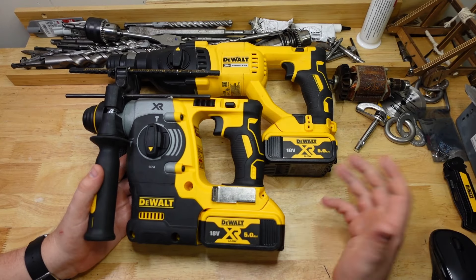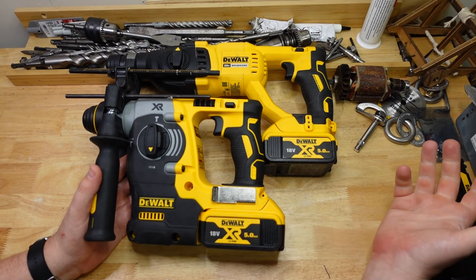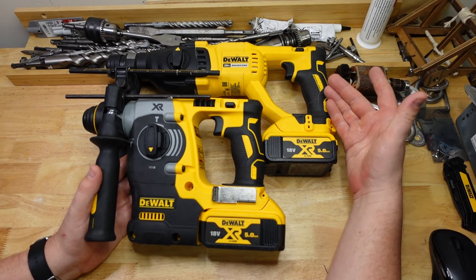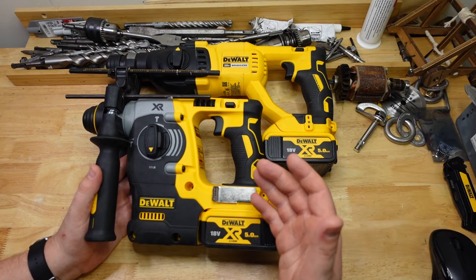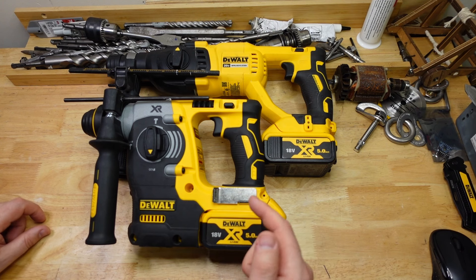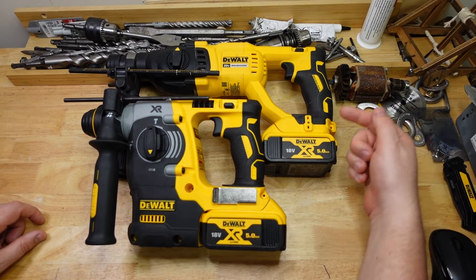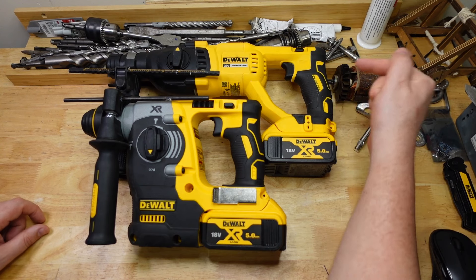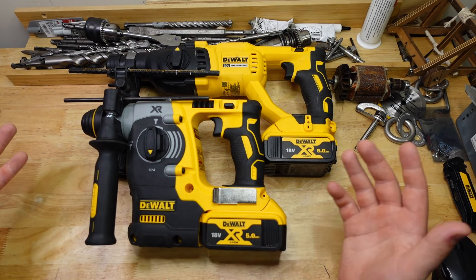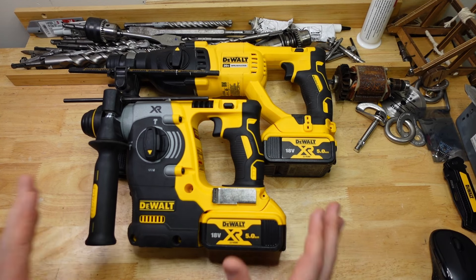Does all this explain the price difference? Not quite. The 273 does have much better features, but is that worth the almost double price tag? Not really. I think they're selling the 133 as a loss leader — basically not making any money off it, just trying to sell units and get people using DeWalt. If you're trying to decide between the two: if you're drilling bigger holes or using it all day, go the chin — the 273. If you're drilling more smaller holes or only using it occasionally, the long boy will be fine. A 15-20% difference in drilling speed may not matter much, but if you're using the tool a lot, the 273 is absolutely the way to go. Your hands will thank you.